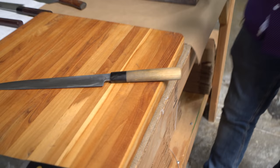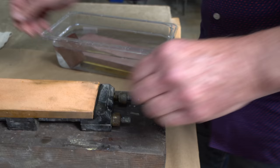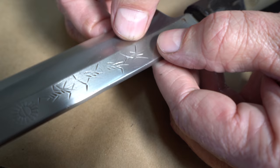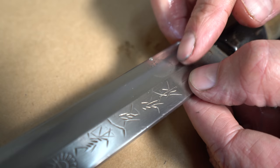The Ura can be extended a little to make it stronger — up to about an eighth of an inch — but don't go beyond that. Once the initial Ura is set, you don't need to come back with a coarse stone. The fine stone is all you'll need on the backside. Sharpening a traditional Japanese knife is very easy, but also very technical. Starting with the coarser stone — this one is 1,000 grit — this is the side where we do the vast majority of sharpening. This big, long, flat section is called the Shinogi line.